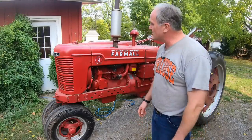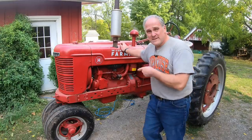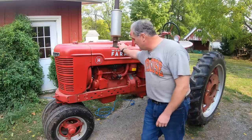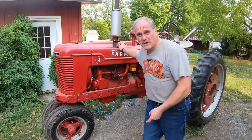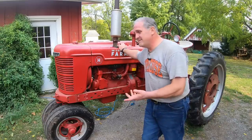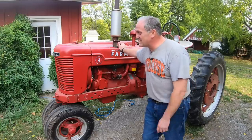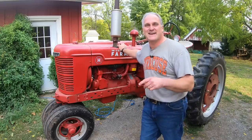I put her on the trickle charger to top off the battery before I bring it back up to the barn. I don't have an immediate use for this tractor, but I wanted to get it fixed and it was a nice break from the normal routine of farming. I think I finally learned my lesson with magnetos — I went on eBay and ordered a used battery ignition unit for this tractor. In the end, if you've got a bad coil in a magneto, it costs about 60 bucks to get a new one. If the coil ever goes bad on a distributor, I can run right down to the auto parts store — they're like 10 or 20 bucks, and a lot easier to diagnose and fix. So I'm going to battery ignition on this. I hope you enjoyed this video. I'll be doing more videos about fixing things on tractors. Have a great day and I'll see you next time.